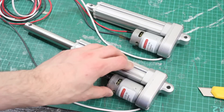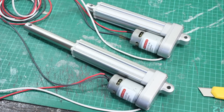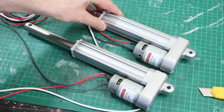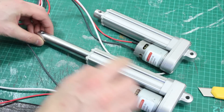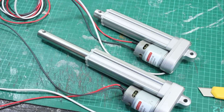I got these actuators from Gimson Robotics — have a look at the Gimson Robotics website for all your robotic actuator needs. These have actually been custom-made, so they go faster than the cheap ones you get on eBay, and they match the existing actuators. One of these is retracted at the moment and one is extended — I've got about 100mm of travel, which is about the same as before. And when these are extended, they're incredibly rigid still, which is exactly what I need to get rid of that wobble.